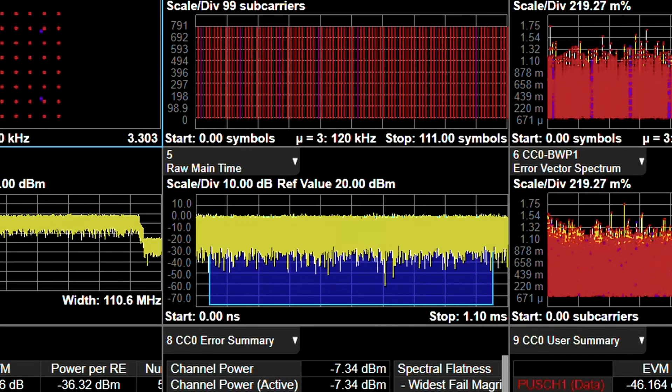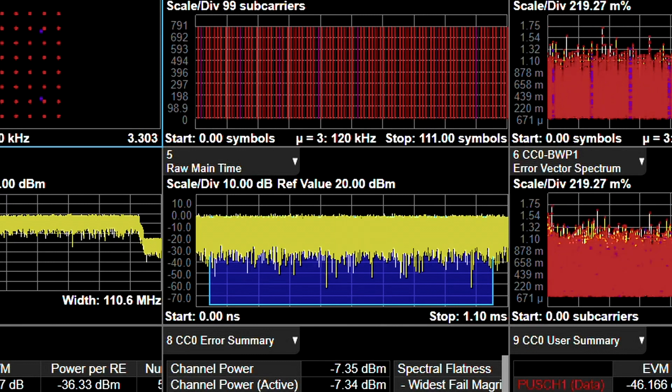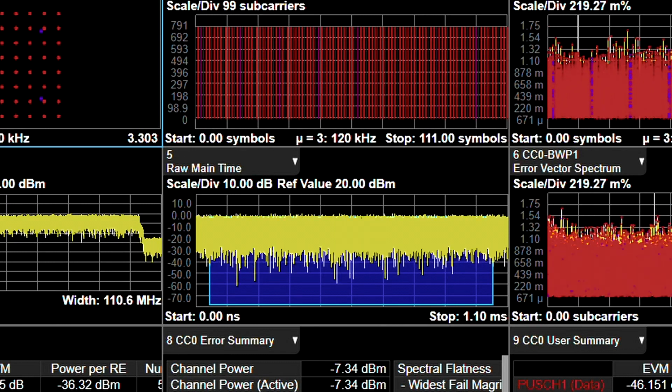When you're making EVM measurements, you're going to have very predictable amplitude linearity and phase linearity. So if you have an equalizer turned on, the equalizers are going to be able to lock very quickly to your signal and aren't going to have to do that much correction. If you are trying to measure the impairments, you're going to be assured that the impairments are in your DUT and not within our instrument.